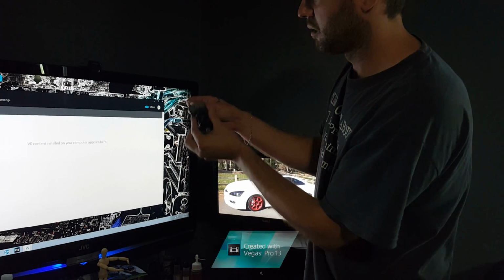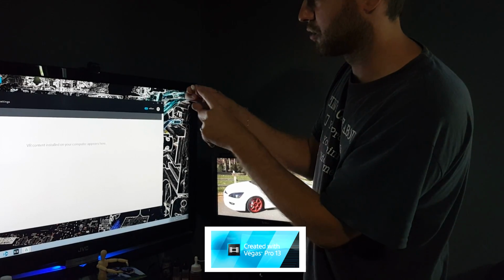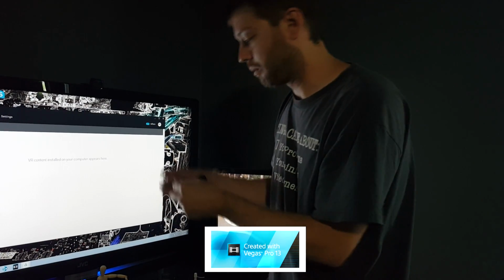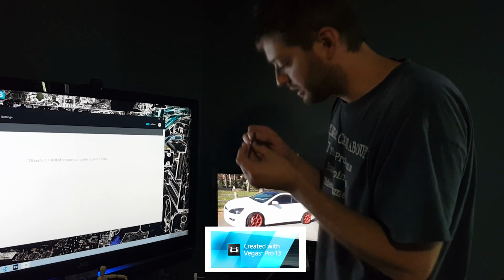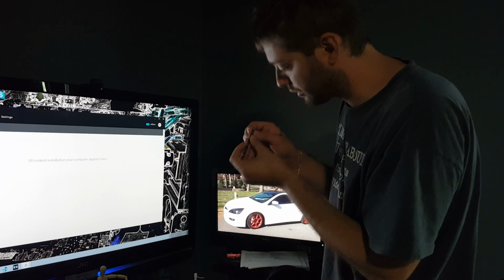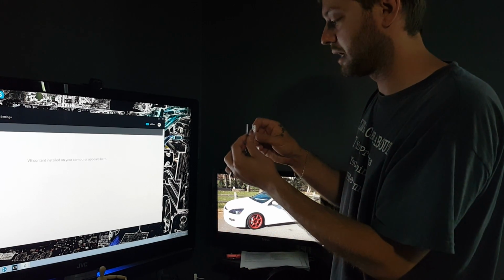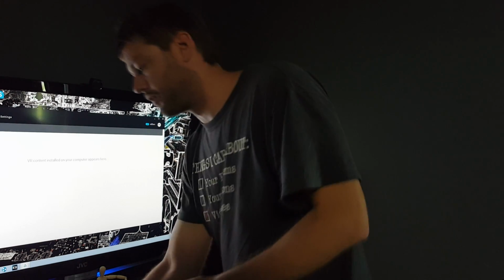So that would be on the wall. You'll line this up and you'll put the screw in through there, and the screw actually goes into this piece, which expands it a little bit and gets a good grip into your wall. The bit that seems to really work well with this one is a 7/32. That's the bit I will be using to drill the hole in the wall for this. You could go a little bit smaller, but that's just the one I'm going with.